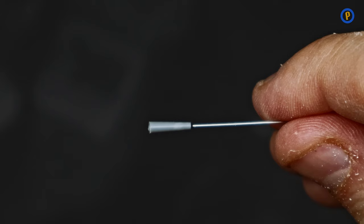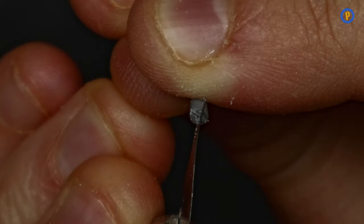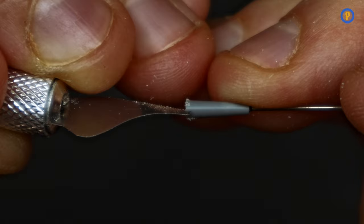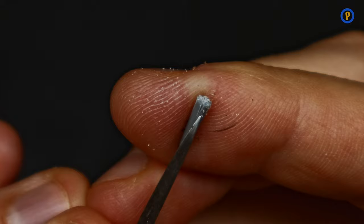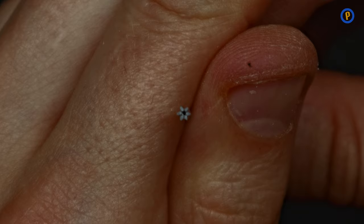To place the carve outs precisely, I used a saw to engrave an asterisk onto the base. Then I transferred the grooves over to the lateral surface. I used a 3-edged engraving tool to deepen the grooves and then refined the shape with a needle file and some folded sandpaper. I removed the excess and tested the fit.